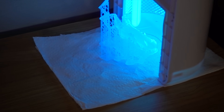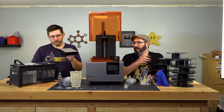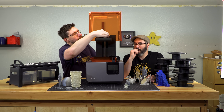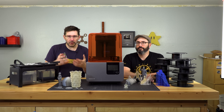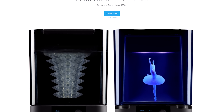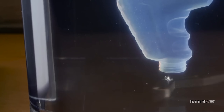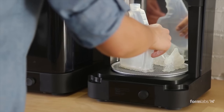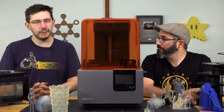These post-processing steps after you've printed your piece are probably the biggest negative to this process, because it's not like you can crack it off the build plate and it's ready to go. There is additional equipment required. Form now makes their own post-curing equipment — the Form Wash and the Form Cure — as part of an all-inclusive package. You take the build plate from the Form 2 and move it to the Form Wash, where isopropyl alcohol circulates around it for the right amount of time. Then you take the model off, put it in the Form Cure UV oven, and once it's done the model is ready to use — or in my case, mold, cast, and paint.